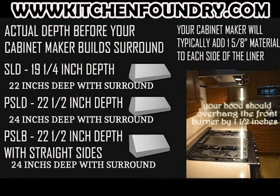You will find the manufacturer offers an SLD, a PSLD, and a PSLB variety. Now the SLD is going to be 19¼ inches deep. Once your contractor builds the box out of 3/4 inch material, it's going to project 22 inches into the kitchen. On the PSLD, once your contractor builds the box, it's going to project 24 inches into the kitchen. The PSLB is a variety of hoods that has straight sides. This is so that they could fit one extra motor in this particular model. It is also a 24-inch depth model once your contractor builds the box surround.